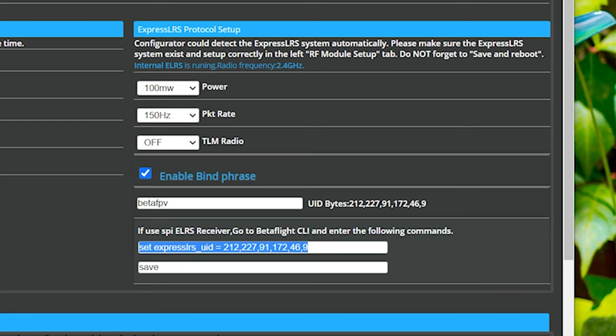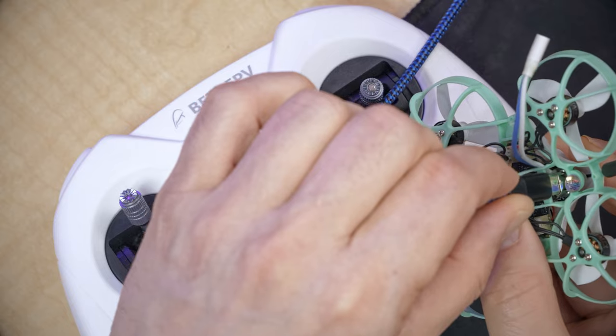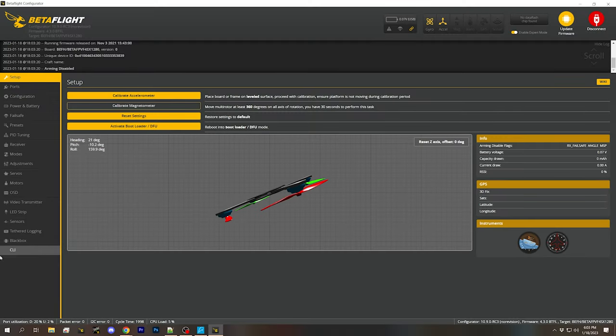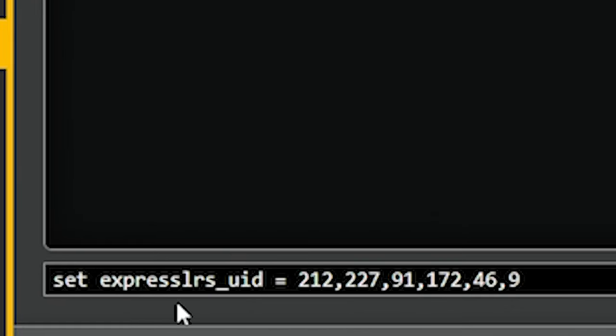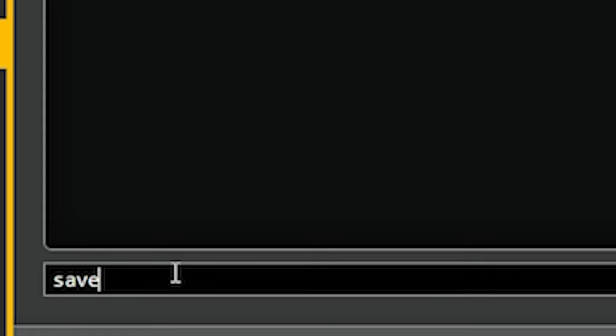The way to put your bind phrase into an SPI-based receiver is to go into the Betaflight command line and put in this string of text. I'll plug in the quadcopter and start Betaflight Configurator. If you're brand new and have never downloaded Betaflight Configurator before, I have a Betaflight playlist — the very first episode teaches you how to download and connect it to your quad; I'll link that in the description. I'll hit Connect, go to the CLI, right-click paste the command. It's there — then I'll type 'save'. Simply putting the same binding phrase into the flight controller and the controller should mean that they're bound.